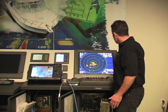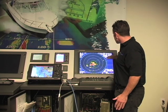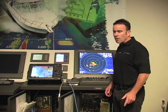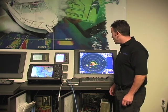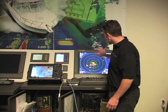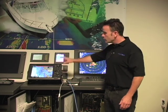Once that's done, you've confirmed your software version and you're sure that you have heading, position, and speed into the X7 radar. You've gone through all the normal setups of the X7 radar including heading alignment, auto-tune initialization, and timing adjustment. You're pretty much set up and ready to go. The goal we're going to accomplish here is to get the targets from the X7 radar over to the NavNet 3D, so now we'll talk about setting up the NavNet 3D.